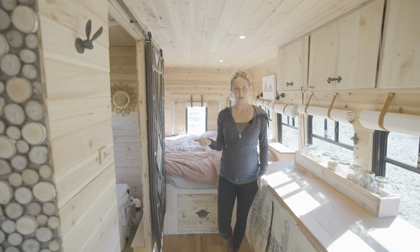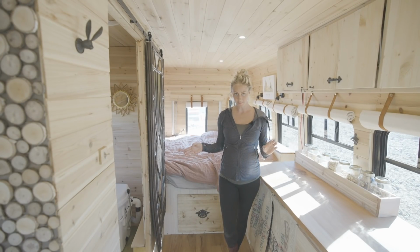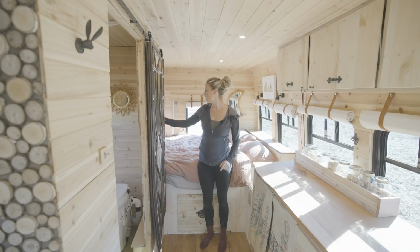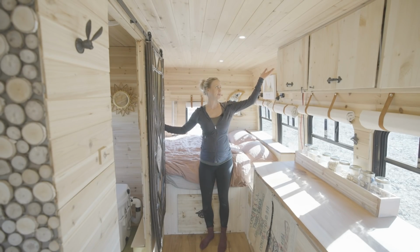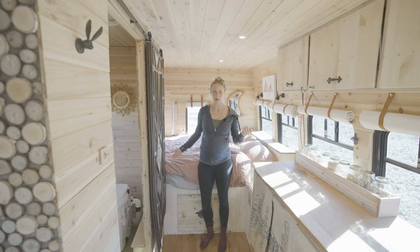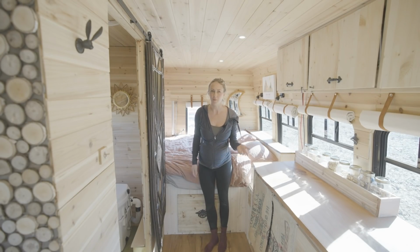The on-demand hot water heater that we have is said to be a vent-free water heater. So the box that it's built into has spaces between all the slats of wood so that it vents, but not outside. It just vents into this area, and that's more for a heat thing. We also have a CO detector that's right here, just across from it, and it has never gone off. So we feel safe with it.